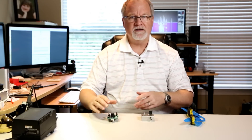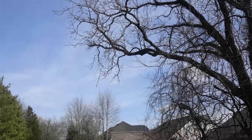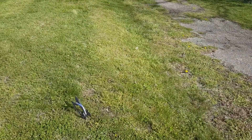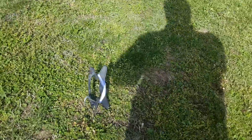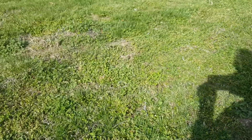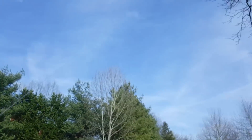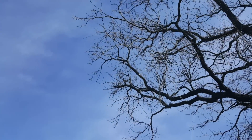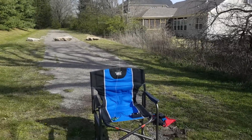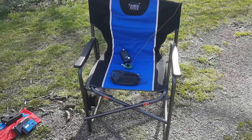So I guess that's enough talking. Here's the video. I've got the antenna set up as an inverted V. It starts where that chair is over there and goes up over a tree branch and comes back down. Here's my fishing line with a wire winder and a tent stake holding it down. If you follow the line up, you'll see where the antenna is attached to it and starts to come over the branch right there.